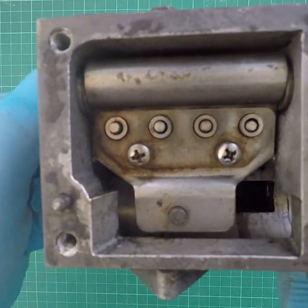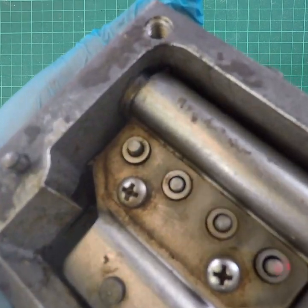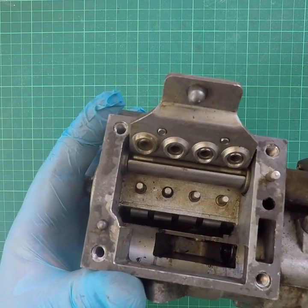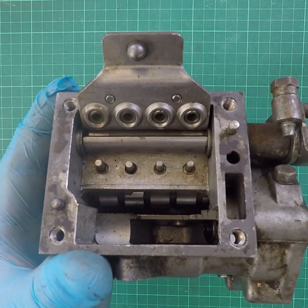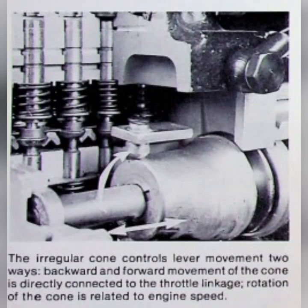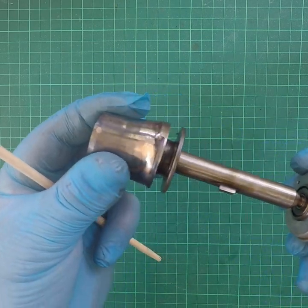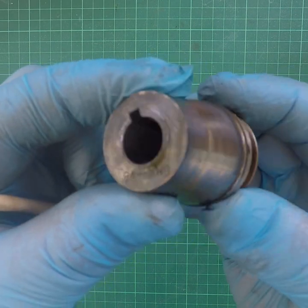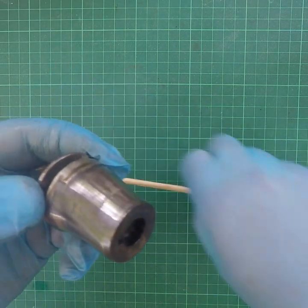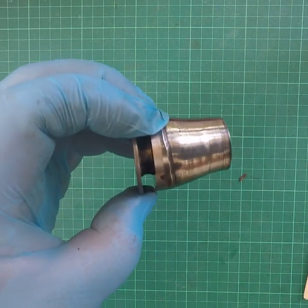This plate is key in controlling how those little spring-loaded pistons fall back. You can see that the external mixture arm — that plate is on an eccentric — controls the height of the plate. The other side of that plate has a cone underneath. So the height of the plate is controlled by two things: the position of the enrichment lever, and the plate bearing against the cone. The cone slides along and rotates through 270 degrees — it's an odd-shaped thing. That is basically the fuel map: a mechanical fuel map customised for the engine in question. Only about 270 degrees is used; it doesn't spin round, it just rotates through that arc in operation.